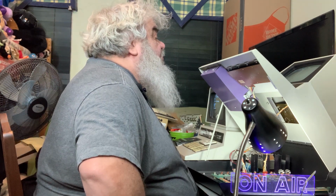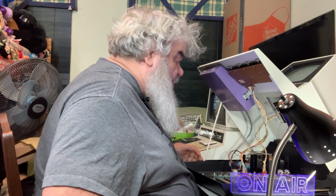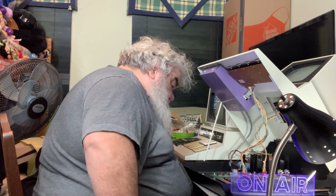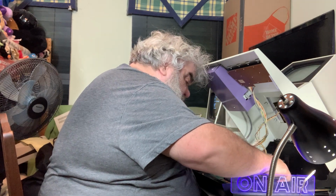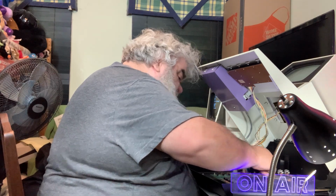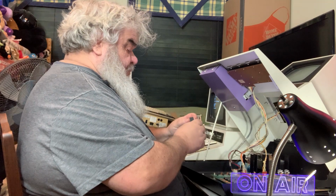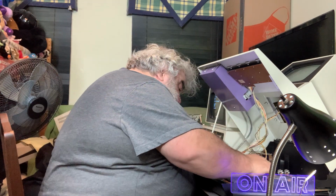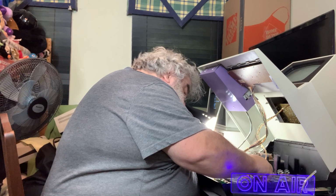Oh, okay, we don't have a cursor. That is not encouraging. Let's try that again. Okay, we do not have... Oh, okay, you know what? Boy, this chip and I are cursed. As I look at this, I do believe the same chip that I was being so careful to make sure I don't screw up on, I was one pin off. So the end pin was not actually in the socket. And that will cause no end of trouble. At least that's what I think happened.